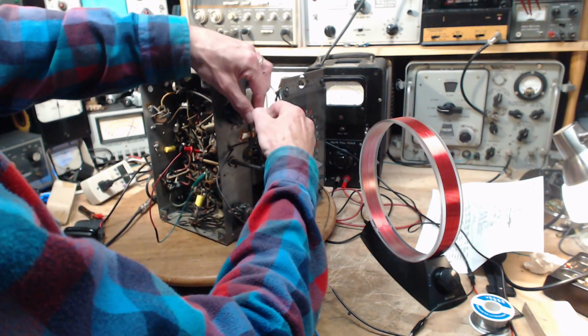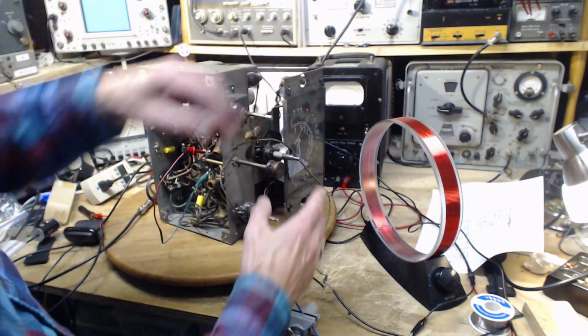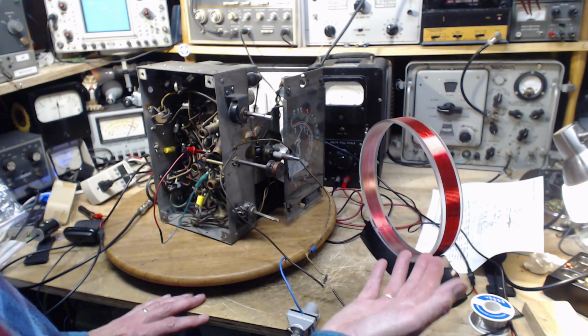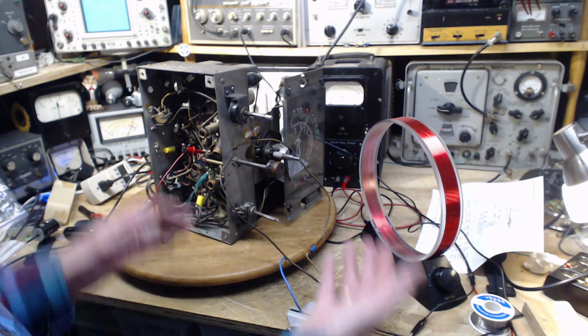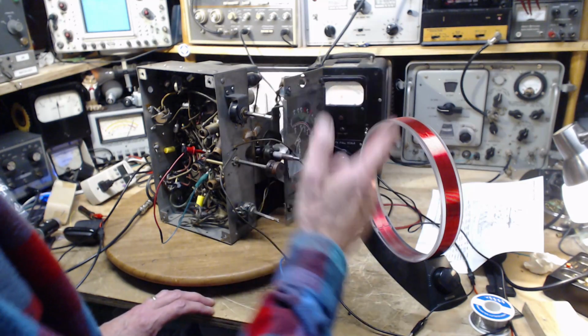Now, why is it so quiet? Let's make sure it's on broadcast. Yep. These antennas are very quiet. They are, to some degree, to the radio, a little bit like a short circuit. Not quite. It's very low impedance, but in place of that low impedance, which is killing the life of the front end of the radio, it provides a strong signal because it's resonant.